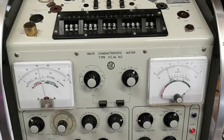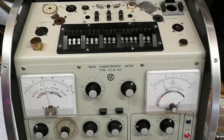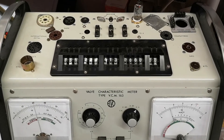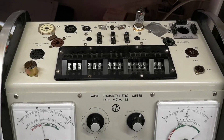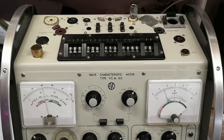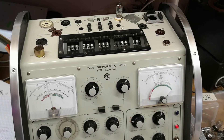Let's try the other one again — nearly 1.6 gain and 1.2 milliamps. So now this completely defective, completely trash tube is back in operation. That is so much fun. And yes, just like selling an old used car to some fool — you could sell this tube or put it into some equipment and get it out the door, and probably the customer would never know, because it will actually stay good for a very very long time. It is absolutely crazy. Thank you very much for watching — come back soon!